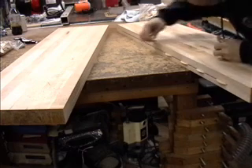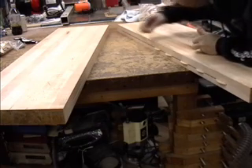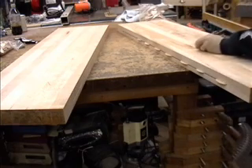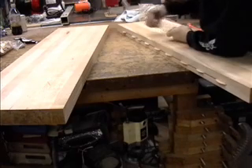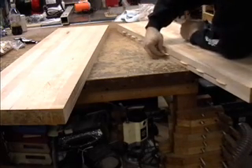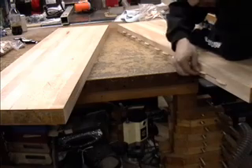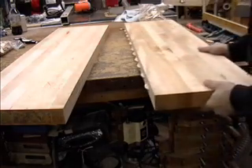As long as you are consistent, cutting both boards either face up or face down, and the thickness is the same, the biscuits will join a perfectly level and flat surface. I line the entire slot with number 20 biscuits. When I glue these in, they will swell and lock into the slot in both boards — that will add a lot of strength to the joint, as well as keeping the joint flat and level.